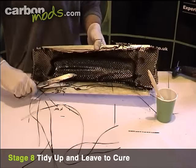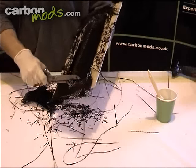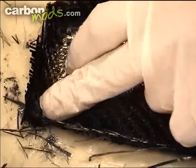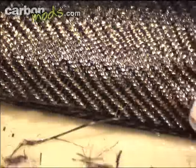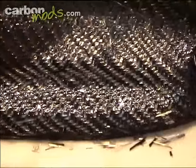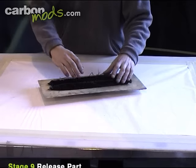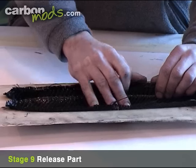When you're finishing up the last stages, go around and trim off the excess — that stops the fibre draping down and lifting off the resin while it's curing. Go around the edges and do a final check, pressing in all the corners and making sure the material is really worked into any sharp negative corners before you set it aside. You've got a good long working time on your mould. Once you're happy, set it on one side and leave it to cure, which could easily take a full day — leave it overnight and come back to it in the morning ready to release the part.